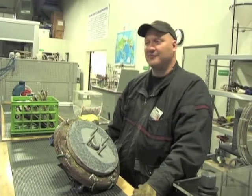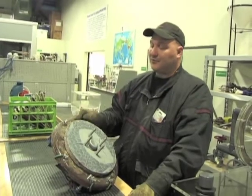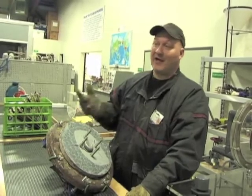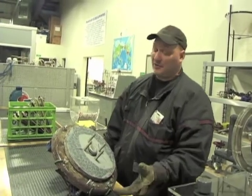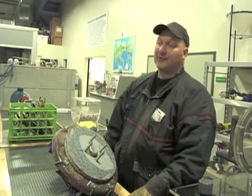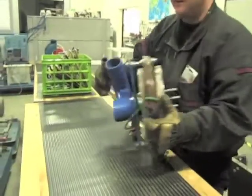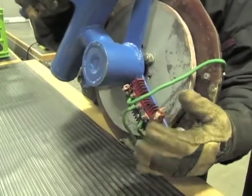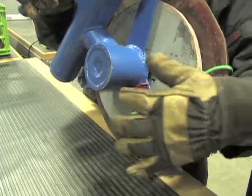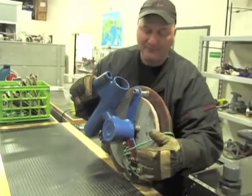Most of the steel was scavenged from the junkyard. We purchased the things that are too hard to get, like wire and all-thread — and actually the junkyard had a whole bunch of all-thread they gave me, so I didn't even have to buy that on the Nome trip. We also purchased the hubs, automotive resin, and the rectifier — the strange red finned thing. This takes three-phase AC electricity and converts it to DC, where you basically have a positive and a negative, just like a battery.